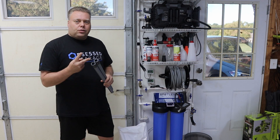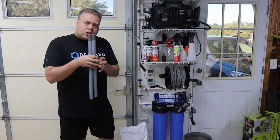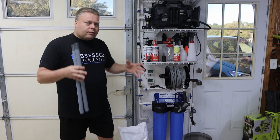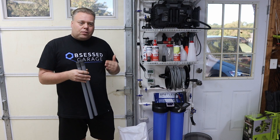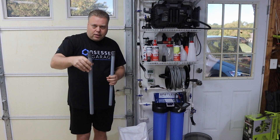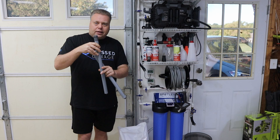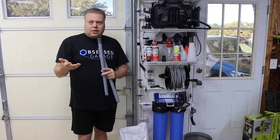So the theory behind this modification is two things. Inside the 20 inch filter housing is a filter but it's much smaller than the actual housing, so there's a lot of space that water fills up. What this modification does is you take the filters out and basically fill it up completely with just resin, and then this tube goes down the middle. It has little slots down here at the end — this goes up into the main tube and creates the filtering process.